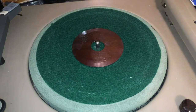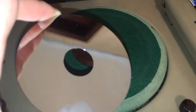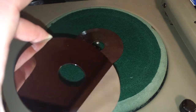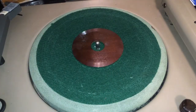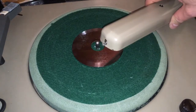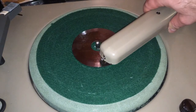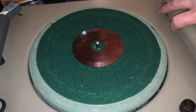Here is one that has not been cut, and of course it has a nice smooth shiny mirror surface — and my fingerprints. So I had to do a couple of things differently to cut sound onto this. There are some limitations. First, there's a time limitation because the travel of my tone arm — my cutting head — can only go so far in. That limits me to about five, six, seven seconds of recording at 78 RPM.